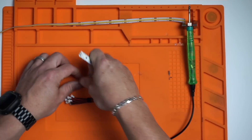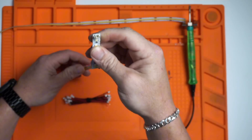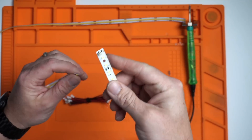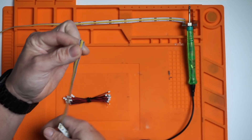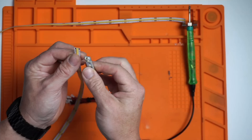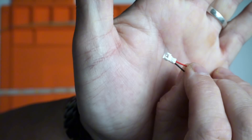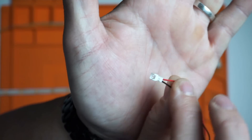On one of the strips you're going to want to put a connector to tie into your machine. You need to match what's on the machine — since the machine has a male connector, you need to install a female connector onto your light strip. That way it's plug-and-play into your K1 Max. It's just a little two-pin female connector — nothing crazy.